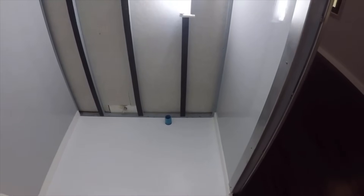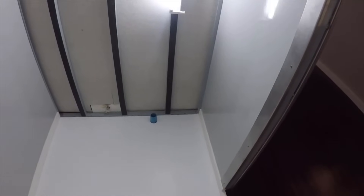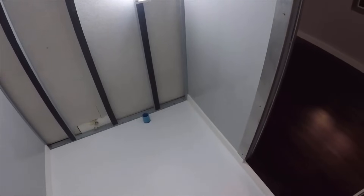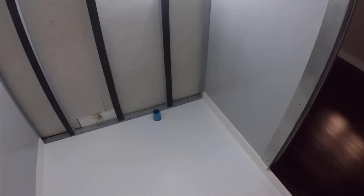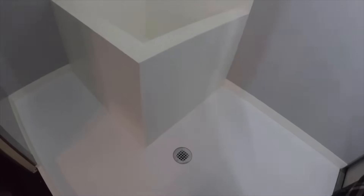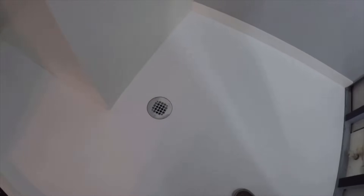To the right of the vanity will be the toilet. Like many other homes we've seen, we'll have a regular flush toilet flange-mounted flat in the finished floor. Because it's flush and flat to the floor, you could put a composting toilet right over top of it, so you have choices. Any problems with a broken supply line or drain line — you have this floor drain as a backup, which works really well because of the thermoformed floor that slopes to the center drain.